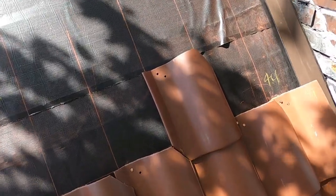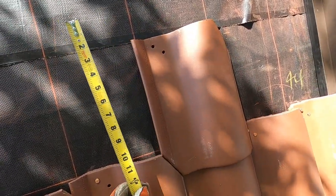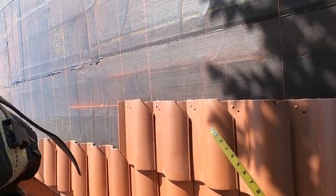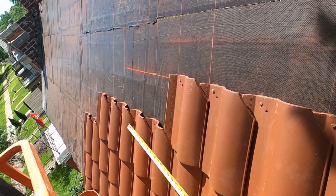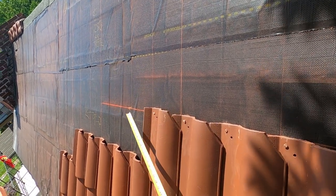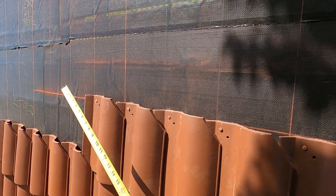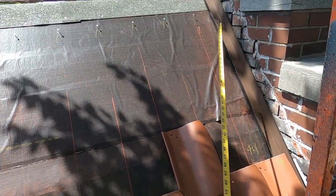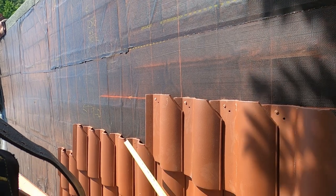So up from this line is 10 1/4 inches. Now I could stretch it up a tiny amount, and it wouldn't affect this 3 inches. But I need to deal with this. I started at the eave, and the eave is apparently straight across, horizontal, but the ridge is not. It looks like it's dropping down an inch. So I could keep running up with this, and the middle tile is just going to be an inch different from those that are on the ends, which wouldn't be that bad